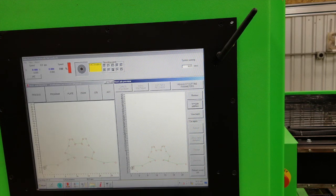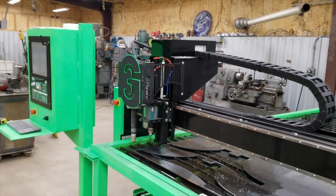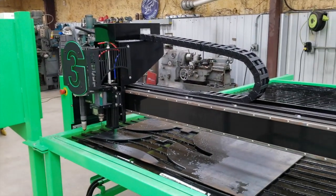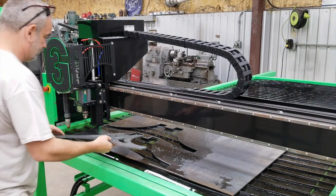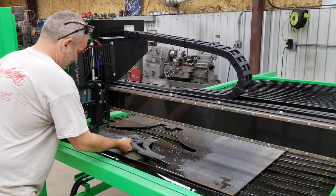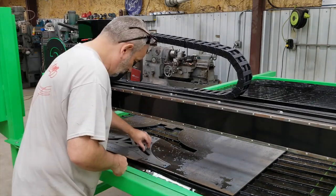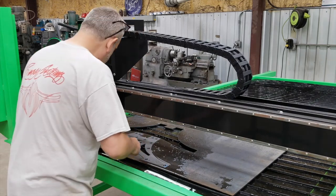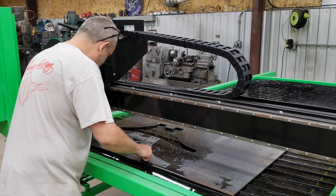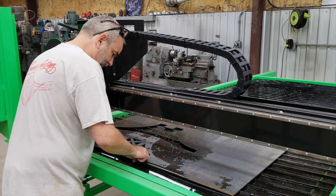We can say preview next job, so now we've got that in our next job cutting window and it's ready to cut. You can see the machine is set up just like we had it. I'm going to grab one of the plates with holes that are too small and slide it back in there. One of the issues is there's a little bit of play - there's a kerf width of about 80 thousandths - so you can just eyeball it and try to get it centered up the best you can.